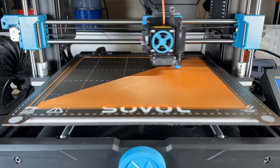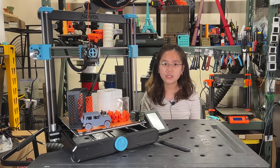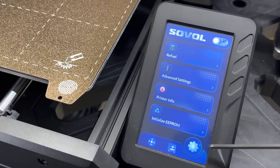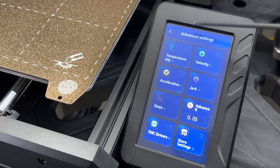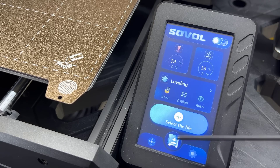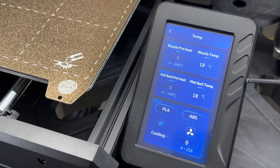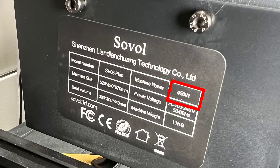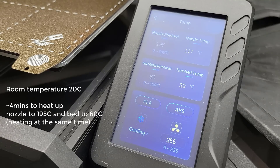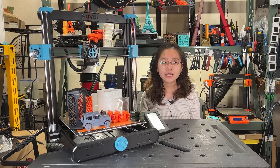This feature, as well as the auto bed leveling, works great on the SV06+. Four: the UI of the color touchscreen is also well-designed in terms of features and menu structure. The dark theme is now the default theme, and although they still have a light theme that I personally don't really like, it is now just an extra option for someone who may prefer it. Five: the machine has a 450W power supply, which is better than most budget mid-sized printers with 350 or 360W power supplies. It can heat everything up within a reasonable time frame.